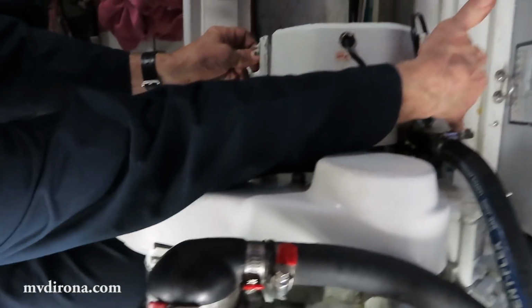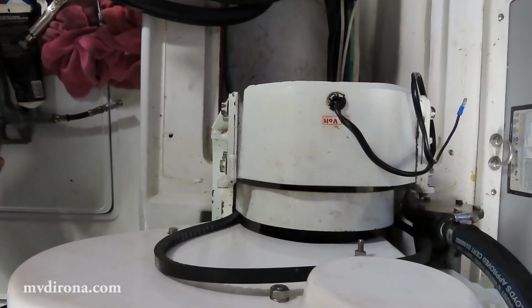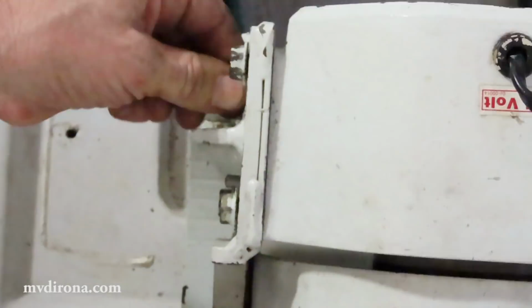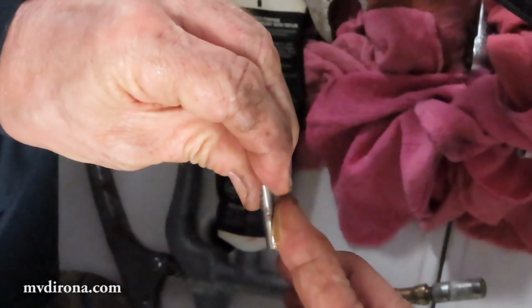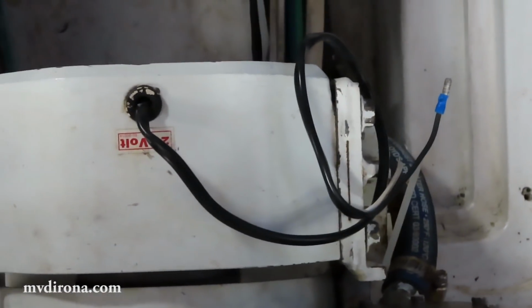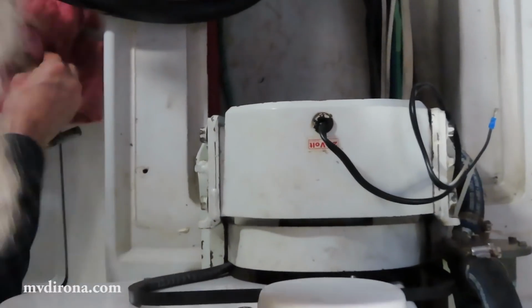I've gently pushed the pins in to align everything. And now what I'm going to do is pull them out one at a time, put a little bit of lubricant on each, and then gently tap them in place for final alignment. That's the first of the 4 pins. And that pin's not going in, so it's not quite aligned. There we go. That's aligned there. Super, super sensitive. Tiny shifts.